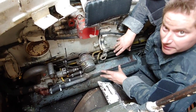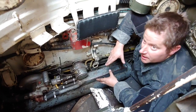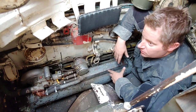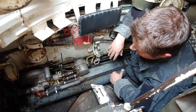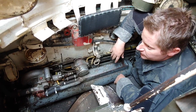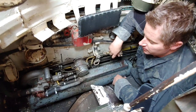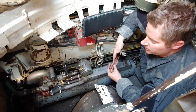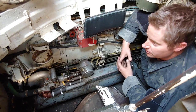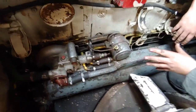I really like this unit here — this is a very old, reliable mechanical way of heating the engine up prior to a start. Being in northern Europe with very cold climates, it's a big ask for a diesel. Most of you that drive a diesel would be familiar with a glow plug — basically just a plug inside the cylinder that glows a little element to heat the cylinder. But in areas where these tanks operate, where it gets extremely cold, a glow plug is not necessarily enough to preheat the engine — so that's what this unit does.